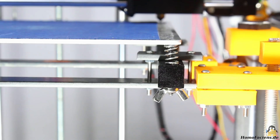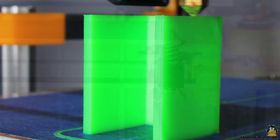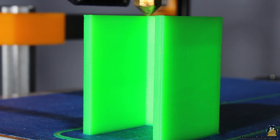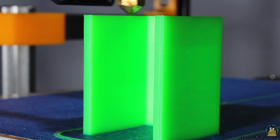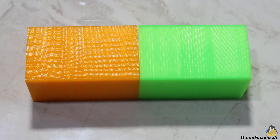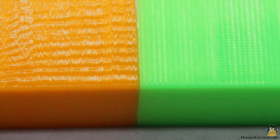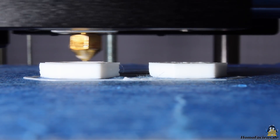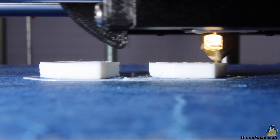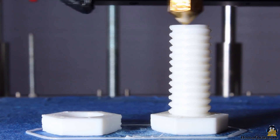The new mount of the print bed is very rigid in both horizontal and vertical direction. Once more I am doing the test print at the front edge of the print bed. Now the faces are printed with no ripple — the bed vibrations of the build plate are eliminated. Comparing both prints, there is no doubt that the modification was worth the effort. Now you can get quality prints with the Tronxy, it's the way I like it. As a side effect, there are no strings between the parts on the build plate; the printer shows no oozing.